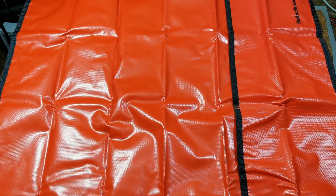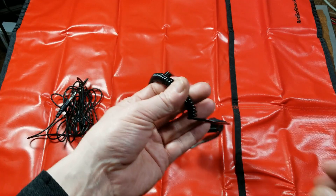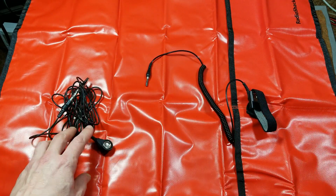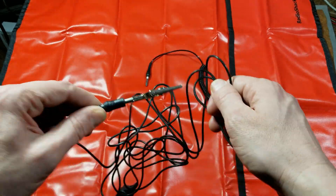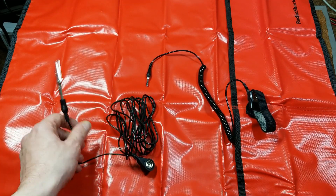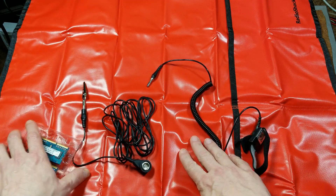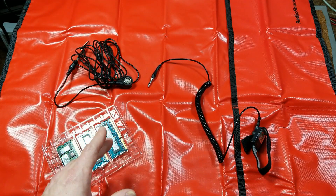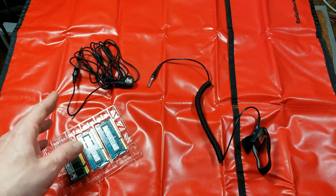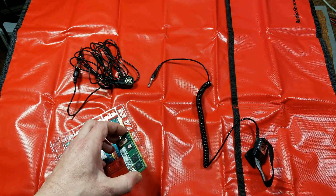Stereo equipment, receivers — you always want to get a decent size one. With a proper cable setup, a decent one will have a coiled wire for the wrist strap so it isn't always getting in your way, and the mat cable will be compatible with any number of ways to ground it out. That way, everything you're working with — both yourself and the surface — is all evenly grounded. It isn't so much about grounding you to the earth as evening the ground level between whatever chips you're working on and your body.